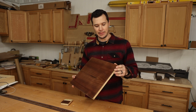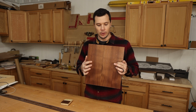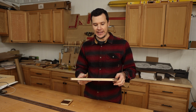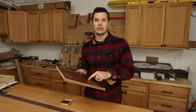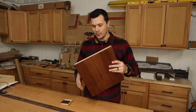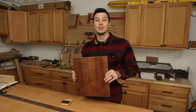Some of the reasons would be I can make this veneer whatever I want it to be. I just happen to have a board of walnut, cut it into multiple pieces, and one little small offcut covered the panel that I needed. And guess what? It's shop sawn veneer. It's super thick, super durable. The core is as solid as can be. The panel is dead flat.